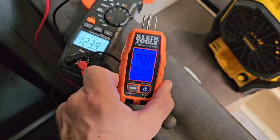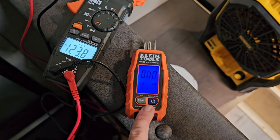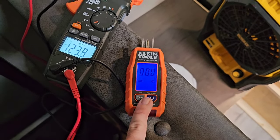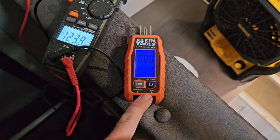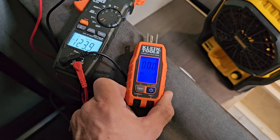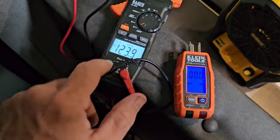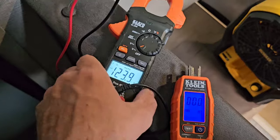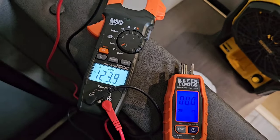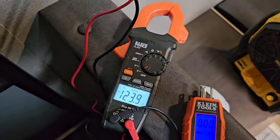This is a good handy tool to have, but if you're running off of a smaller generator that has an open ground — which most of them do — it's going to pick up a floating neutral and give you a false reading. So though this is a good tool to have around, it's a better idea to also have just your everyday average voltmeter around to make sure that you have the correct power coming in from your generator.